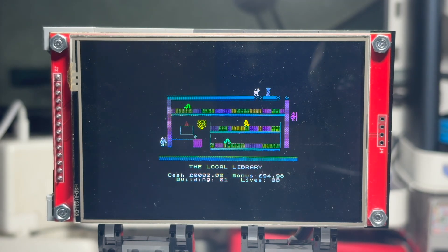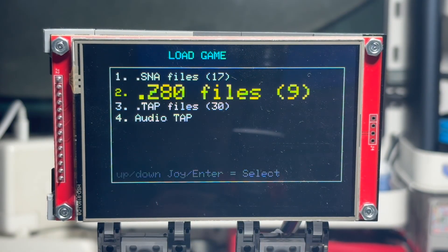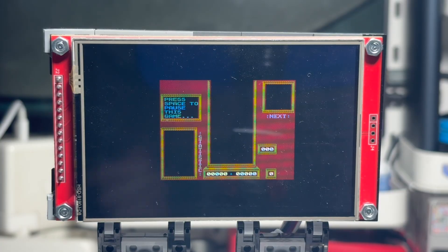The visual interface includes two display modes: pixel-perfect one-to-one, and a zoom mode with 1.0 to 2.5x scaling and panning. The emulator supports the classic .sna, .z80, and .tap formats. Screenshots save as BMP 256x192 into /zx/screenshots on the SD card and are automatically numbered. The menu and file browser have been scaled up to look clean on the big screen.